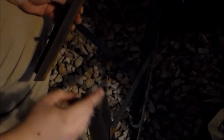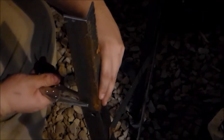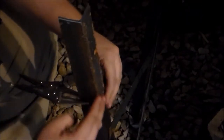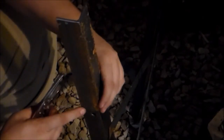Here's the cut and basically the tab I welded for extra support. Here's my nine-inch cut piece which is going to make up the height difference. I'm gonna leave a gap and I've gotta do that on all of them, trying to keep it perfectly square and straight, which is gonna be tough. There are a couple of weld pops on the back side so I'm gonna have to grind those down so it'll sit perfectly flush.